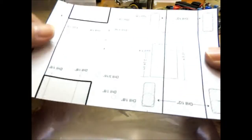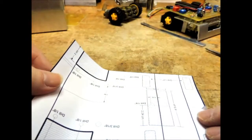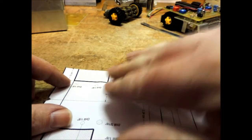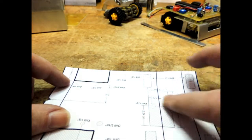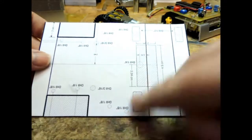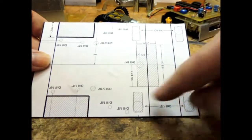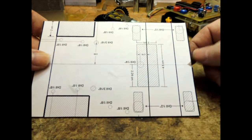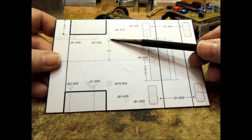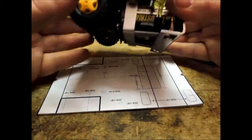Take your layout and don't push it down immediately — you've got a little bit of time. Make sure there are no wrinkles in it. Now I'm going to cut out the cutouts for the wheels, the cutout up front for the LED display board, and the cutouts for the lower sensors. I'm also going to drill out these 3/16-inch holes — that's where the battery wire runs through from the bottom of the chassis. You can see the battery clip runs up and the wires come through right there.